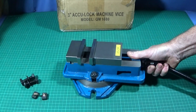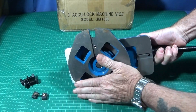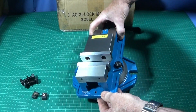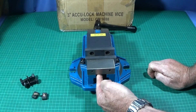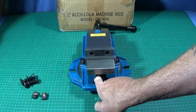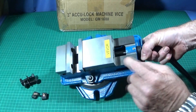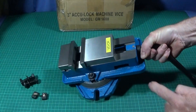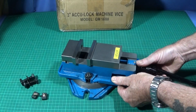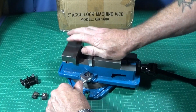The vice looks like this on the underside, and one of the things I really like about it is the open hole at the front so that you can stick a hoover pipe in and suck out all the swarf. I really like the way they've put a button oiler on the back end here. All the different sizes of this Viva vice are well known for the quality and size of the lead screw.